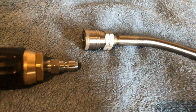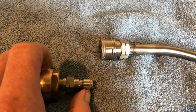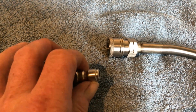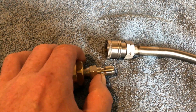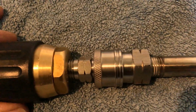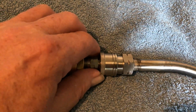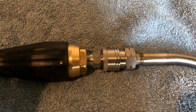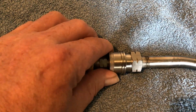So what simply happens is people get mixed up on this. When you come to do the seal, that seal is connected right at the bottom end of it. So it's pushing in and the seal is there. It's not connecting at this point, that's where the ball bearing groove sits. And always remember, before you disconnect, always push the nozzle back before you pull the collar back. Far easier, so you're just pushing gently into the O-ring.